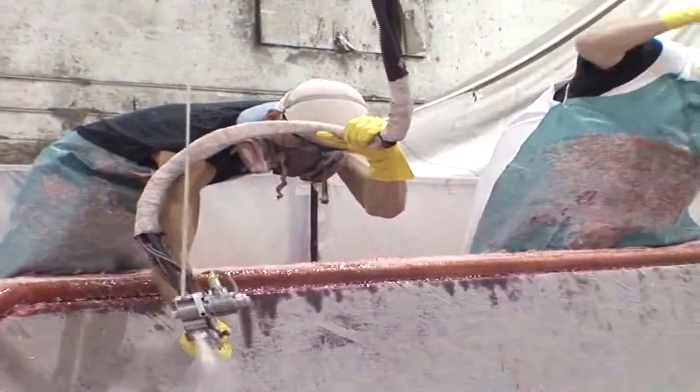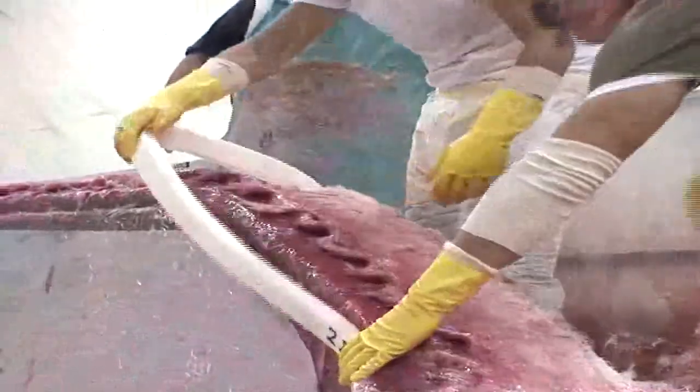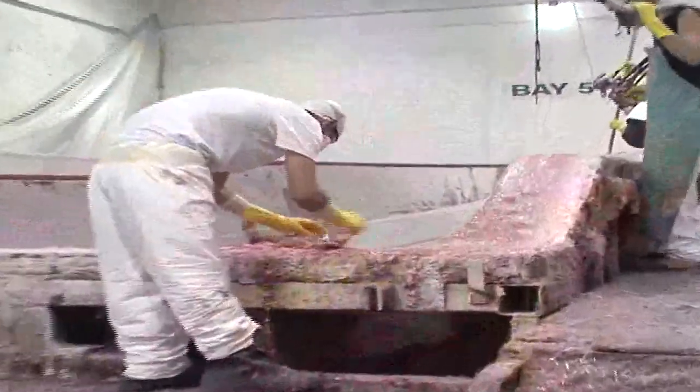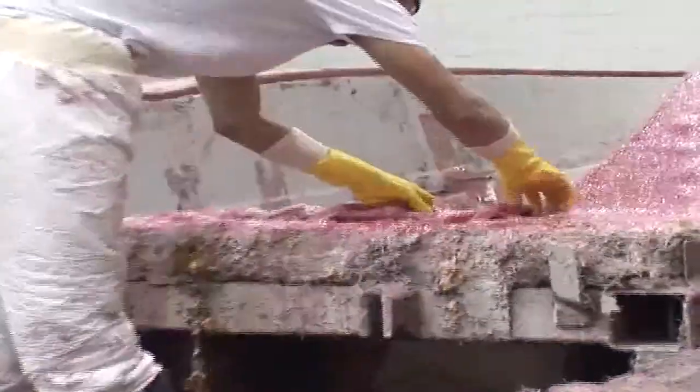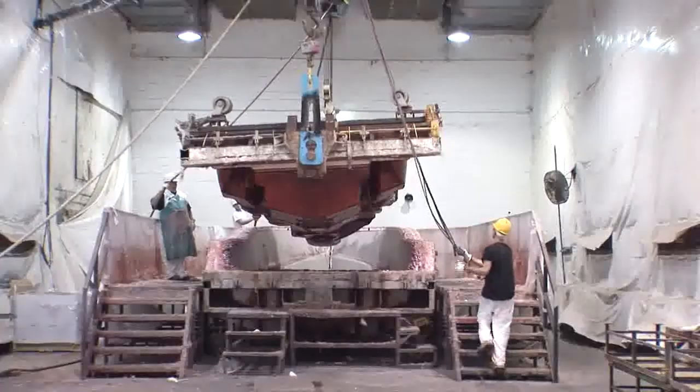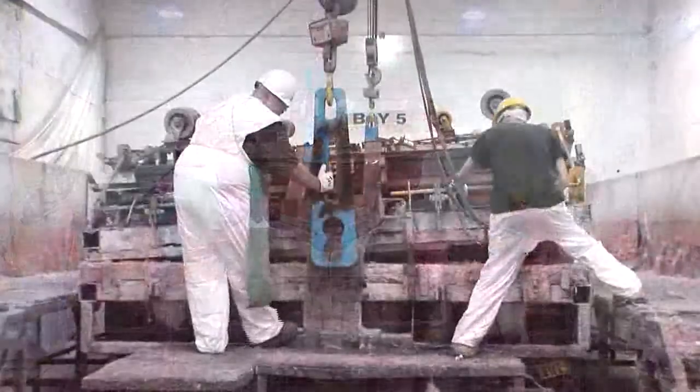During the closing process, our fiberglass technicians apply fiberglass to the hull bottom. Our technicians then turn the fiberglass over on what we call a weld, which is what bonds the inner liner to the hull bottom. We then rotate the hull inner liner 180 degrees and drop it inside the hull bottom, then toggle to cure.